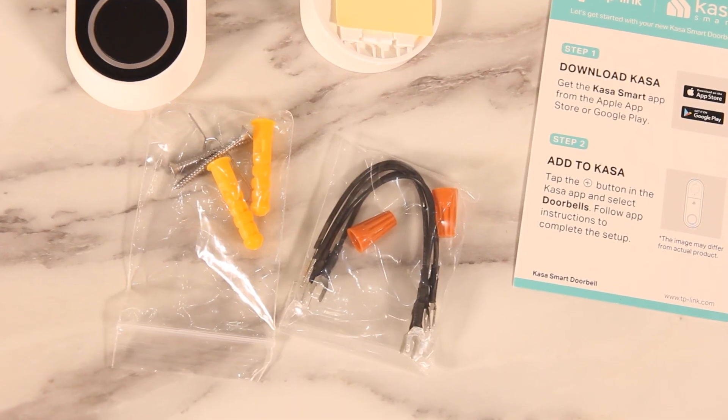Now for the chime. You do not need a traditional chime to install a video doorbell, and in most cases you will have to install a jumper cable in order to bypass it. The power only flows through to the chime when the doorbell button is pushed, so in order to have constant power to the doorbell button location you would have to have the chime always on.